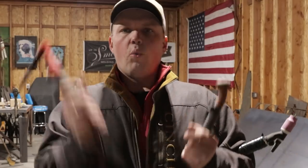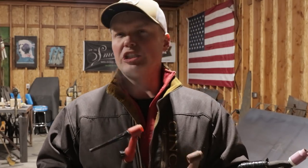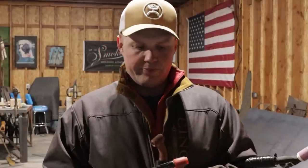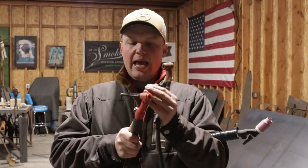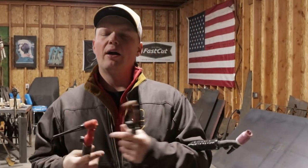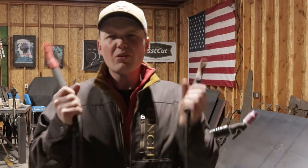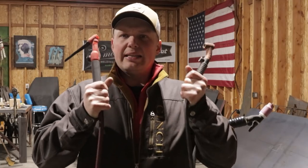Now, one of the things when I was learning how to weld, and learning how to TIG weld especially, is I was really bearing down on that cup. Now, it's not good. Eventually you learn how to be light-handed and you learn how to control that pressure. But when you are learning, eventually this head starts to get hot just from being next to the weld or whatever. And as you bear down on it, that head's wanting to come back. One of the big disadvantages of a flex head, especially when you're learning, is that.